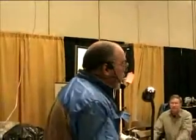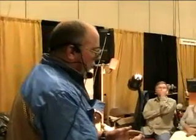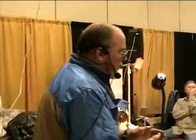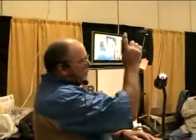Any of you that have cut down a tree, you know the first thing that happens, you look down there and right where the pith's at, you got a crack to start with. What I do is I cut right through the center of the tree, trying to keep the growth rings balanced, okay? Normally, the pith is either to the left or to the right. Very few trees that pith is running straight up the center on.